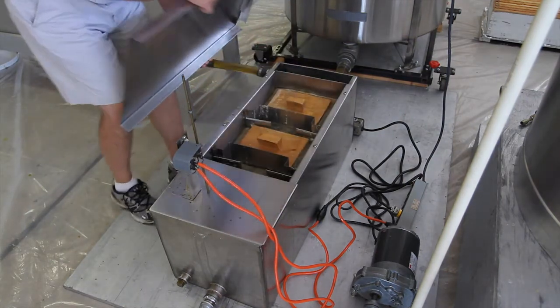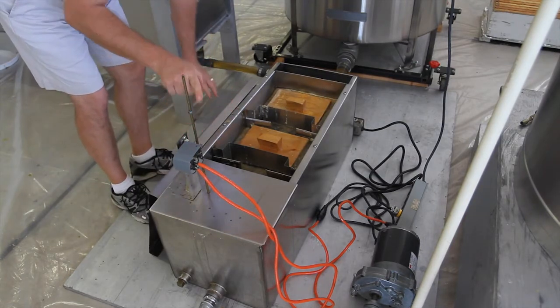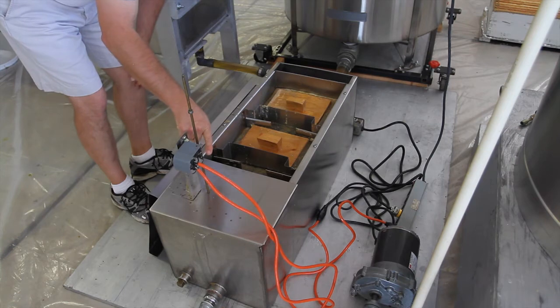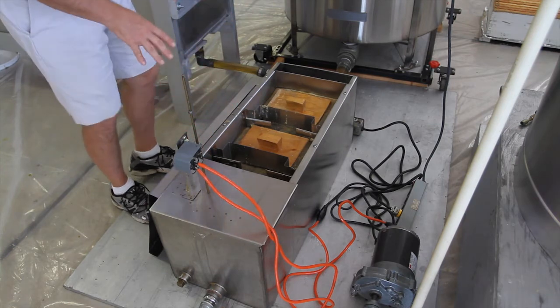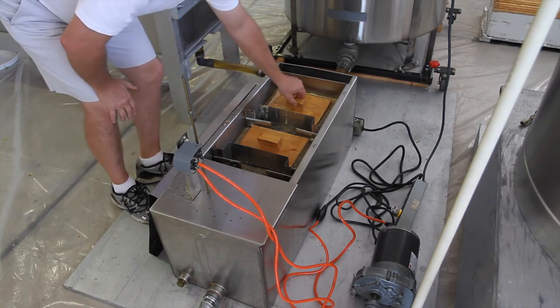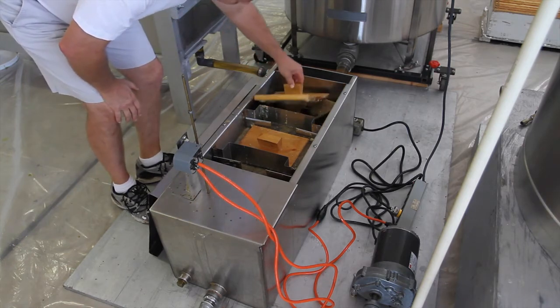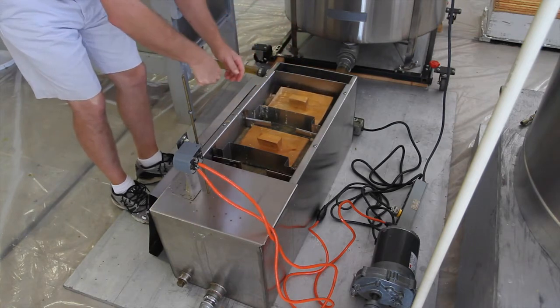There's always a lid on here, but you can see how full that clarifier is. This switch is an automatic switch so it's going to kick on here in just a second. This heats it up to about 110 degrees or so and it causes the wax to float to the top. The wax is caught in these floats — it's attracted to those floats — and then every once in a while we skim those off.